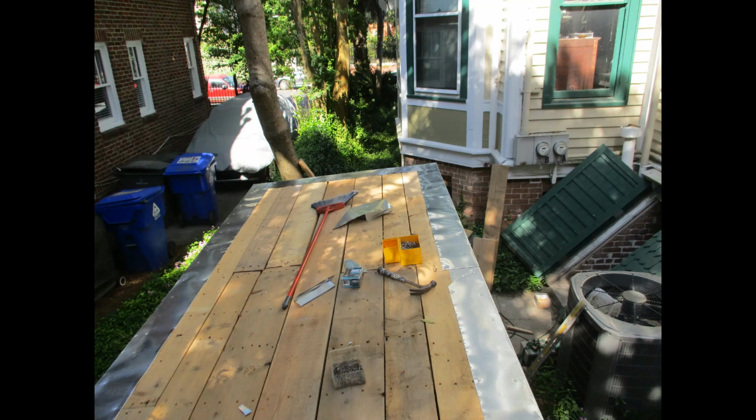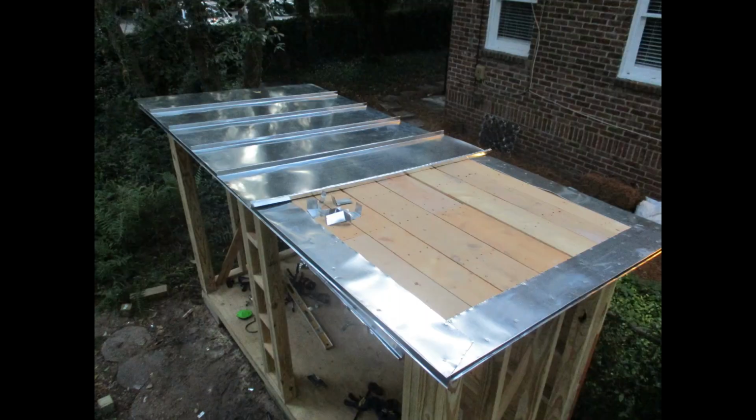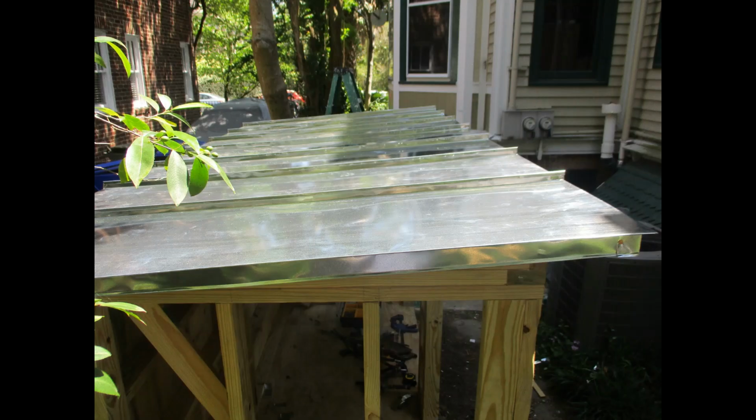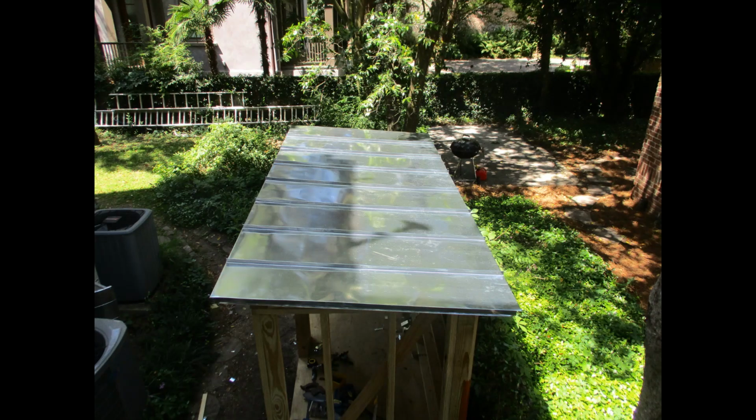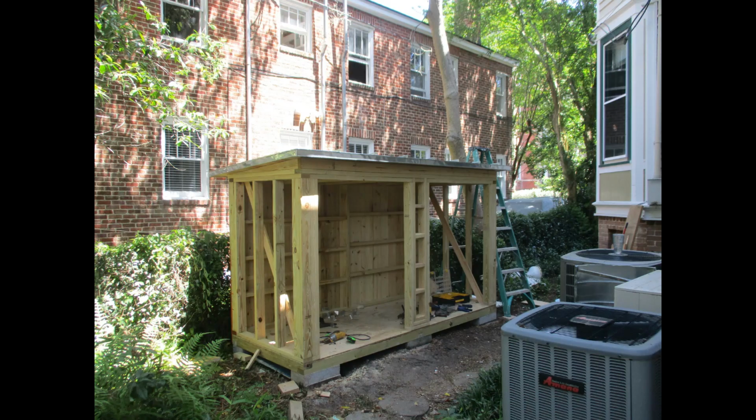And what I did was I fashioned the roof out of, this is an innovation of mine, and I don't know how it's going to work out, but I used 20-inch valley flashing. It's a pretty thin galvanized metal, and I bent those into traditional standing seam profile. And this is showing it on its way in, and so those are bent and crimped and everything as if it were a good material, but I was using a really cheap, cheesy material, and time will tell if it lasts. But it's beautiful. Really, it's very shiny, and it works perfectly. Of course, it's an excellent roof, and this is what it looks like at this point.